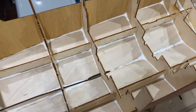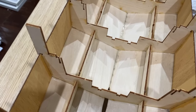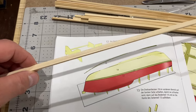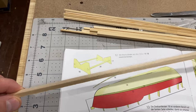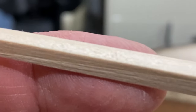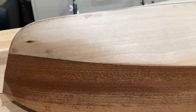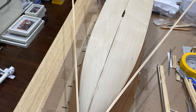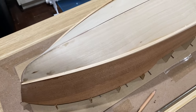All the joints are glued and I'm going to leave that to dry overnight. Once dried, the next stage is to put these triangular strips along the side of the boat at the junction between the sides of the hull and the bottom. I've tapered the front edge of these so they get thinner towards the front. I've given the hull a sanding and cleaned it off with meths before gluing these rails on, starting at the front. I think it'll be easier to bend them around that way. We've got them on.